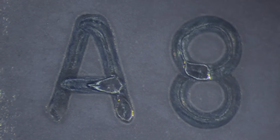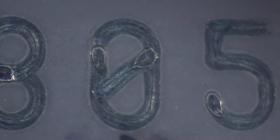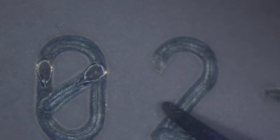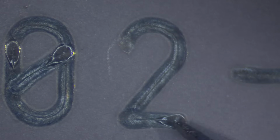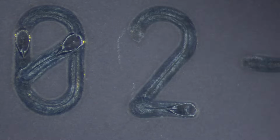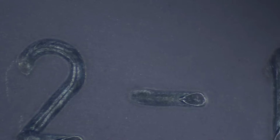So how does our laser engraving look like? Okay, so we see something very similar, I think. Look at the 8. The 8 started somewhere here in the middle, it went around and it stopped here. I think we remember this. The 0 looks familiar. It started here on the top, went around and did this. The 5, the 2. So this 2 almost looks like maybe it's 2 pieces actually. Look at this. So maybe first we did this and then it started a second one and went to the right. We don't see the crater here on the bottom because it is basically over melted by the line on the bottom. We had a 2 on the other CPU as well. Let's double check this. And yes, actually that could be true. These are 2 lines. So, okay, maybe I misinterpreted this before.